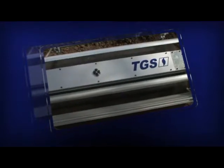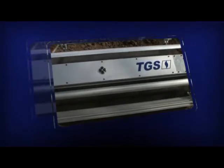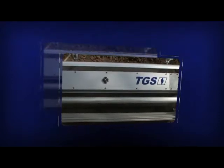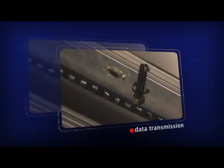The assembly is designed for making one measurement every 2.85 square millimeters, thus reaching a total of 185,000 points in the scanned area. The total scanning time does not exceed 5 minutes. Data transmission. Data is transmitted to a control PC by a Bluetooth system.